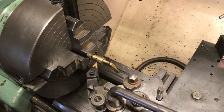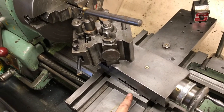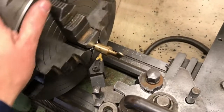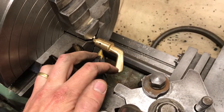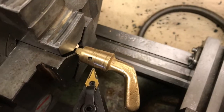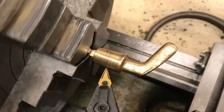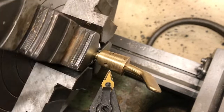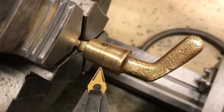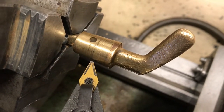Here's the male part of the tap set up in the chuck ready to be machined. I've left the compound slide set at exactly the same angle as on the female part. You've got to be careful with the brass part rotating — make sure there's clearance. I've clocked in the existing taper as best I can, which is probably five to ten thousandths runout. You can see it's got some scores and dinks in it, so once we've remachined this we'll lap them together and show you the finished result with some engineer's blue.